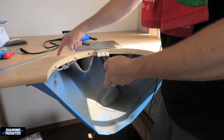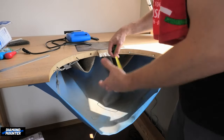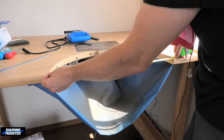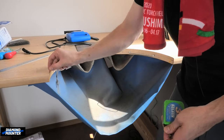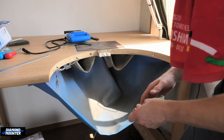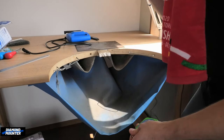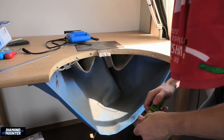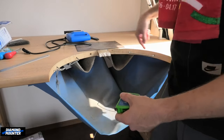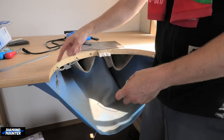When cutting the bench peg shape, my measurements were 23 inches wide and 11 inches deep — that's just what felt right from my experience. I marked those three points and freestyled the curve. If you're worried it has to be a certain curvature, snap out of that thinking — that's not a creative mindset. You're free to do what you want, and if you don't like it, get the jigsaw out and adjust it. Everyone's body size is different, so you may want it wider, narrower, or deeper.